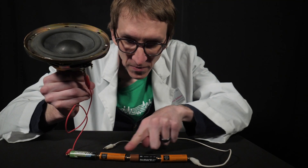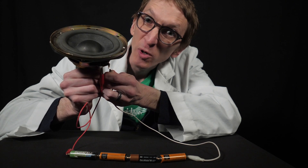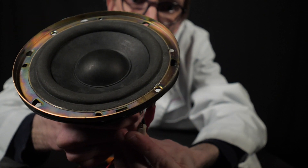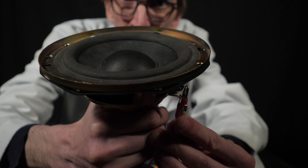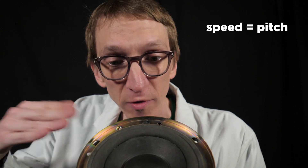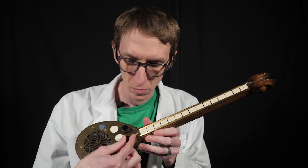I've made a circuit right here — I have some batteries connected together and these alligator clips are right by this, so when I touch the contact the speaker pushes forward. Now if I were to switch these around the electricity would run through it the other way and it pulls it down. It's so simple: run a positive charge through it and it moves one way; run a negative charge through it and it moves the other way. So to create a vibration we want our signal to move up and down repeatedly. All synthesizers have something in them called an oscillator — an oscillation is a fancy word for something that moves back and forth like a vibration. I can control how fast it moves and how far it moves. This is the ultimate vibration-making machine, which is why I like it so much.